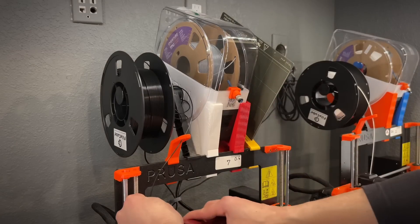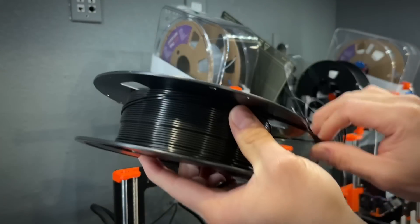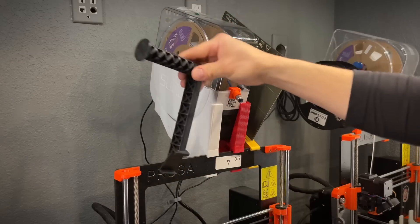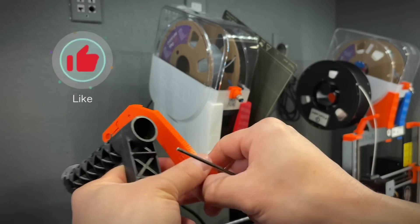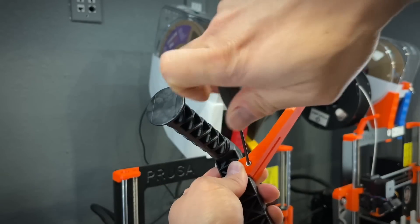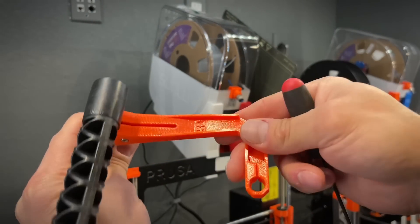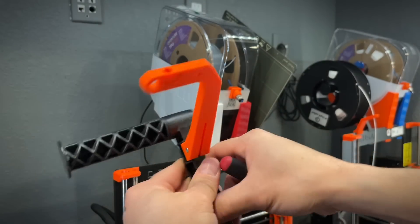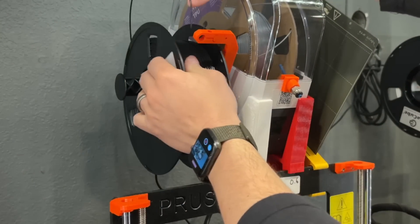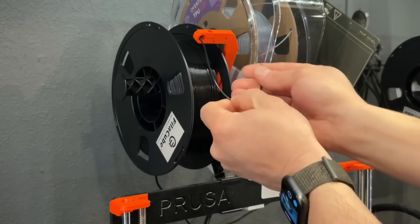Here's the one I want to replace for sure. To get this off, I'm just going to cut the filament, pull the spool off — I'm going to have to rewind this someday. I'll go ahead and take the old filament guide off and toss that in the trash, and then take this one off as well so I can put the other piece on it. I was smart this time and actually inserted my nut first. So I'm going to go ahead and clip this onto there — I've got my screw in there already — and just hold that with my other finger and screw it tight. I'm not going to use a PTFE tube; this is actually printed in Prusament PETG, so I don't really need that. Then I'm just going to go ahead and attach it back onto the printer. And then my fresh spool of filament — I'm going to put it through there and you can see it's grabbing it right as it comes off the spool. Since I don't want to load it right now, I'm just going to put it in standby mode.